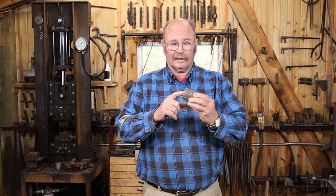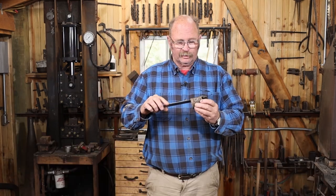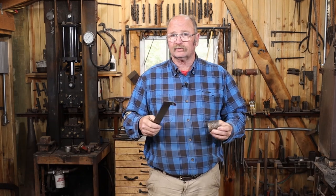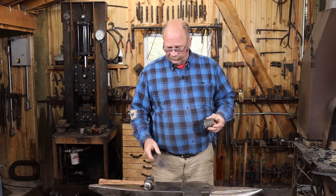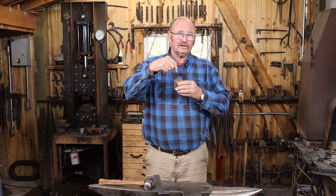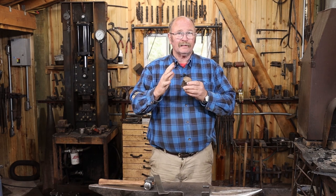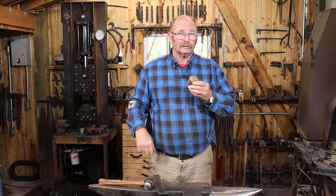The first step — I need to make a heading tool to do a nail that big. I'm going to do something that I should be able to use at the anvil, power hammer, or press. For that, I've got this piece of round bar left over from when we made the rounding hammer. This is two inches in diameter and just a little bit over two inches long — about 50 millimeters by 50 millimeters. I'm going to want a square hole in this but I don't really want to spend the time punching it, so I'm going to go ahead and drill it. I think I'll do that at the lathe and then square the whole thing up, so my round hole will square up right along with the block.